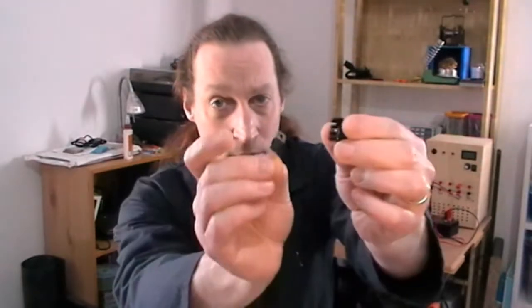This is a TIP 120, TIP 120 I call it, but there you go. It's a Darlington transistor all-in-one package. Comes in a TO220, is it? Package, and works really quite well. On the front here, it says it's a TIP 120 Darlington NPN 60 volt 5 amp. So that's a lot of power. So this thing is going to get warm. Obviously in this package you can bung one of these on, which is a heatsink. So bolt that onto there.